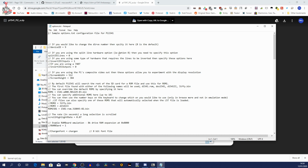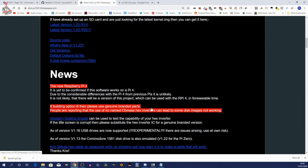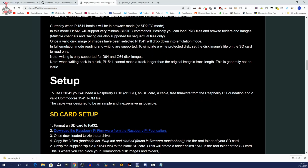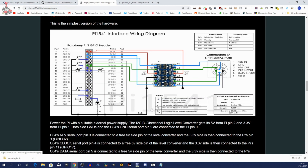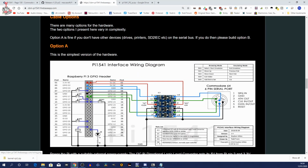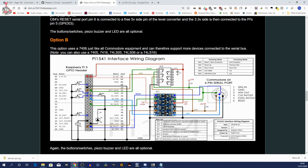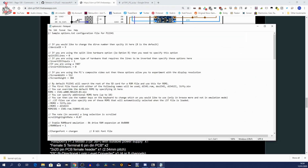But if you've got option B instead of option A, you can find out from here, it shows you what the different options are. So the official Pi 1541 web page has information about option B and option A here. But typically, if you've got one with just one serial port, it tends to be option A. Then you would need to change that to one if you've got one that needs a pass-through. Okay,